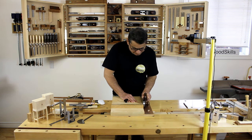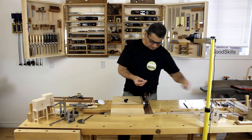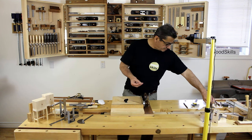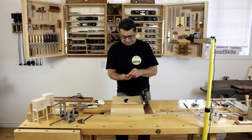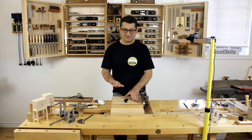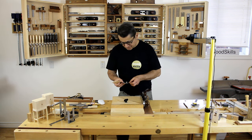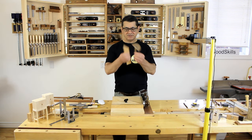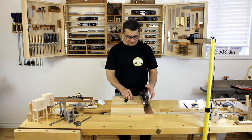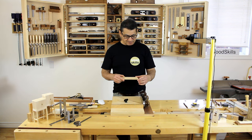There's a little technique to using a shooting board. You can see the shavings removed. Determine the thickness of these shavings using a small dial caliper or a conventional sliding caliper. Once you're more familiar, you can almost eyeball the thickness and determine how much to remove from the end of a board. When using a 45-degree attachment, get a protractor and set it to exactly 45 degrees to ensure an accurate cut.